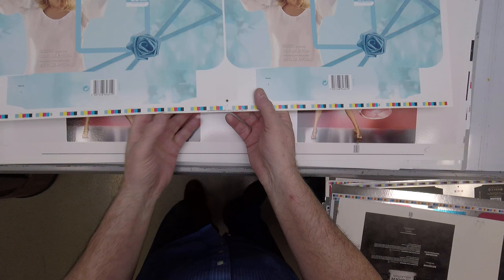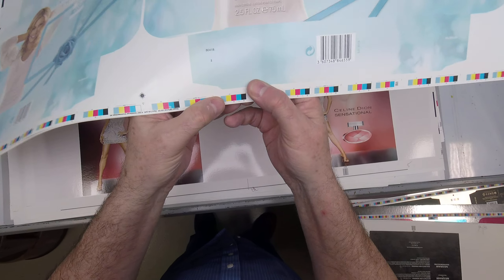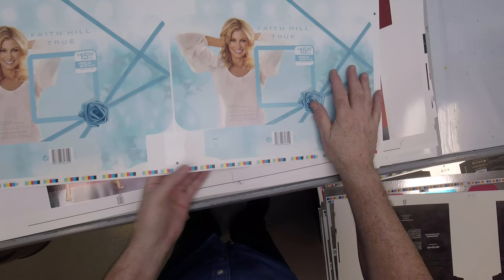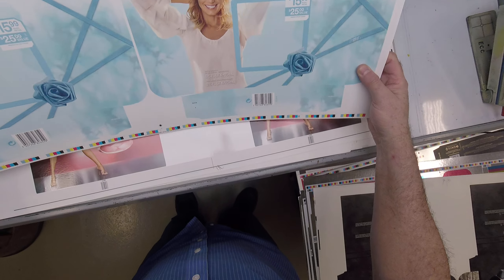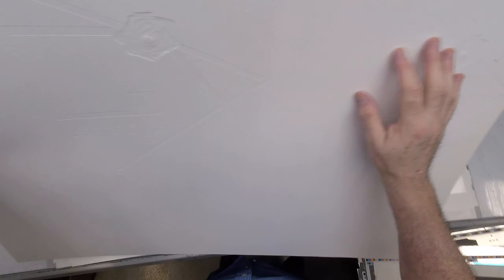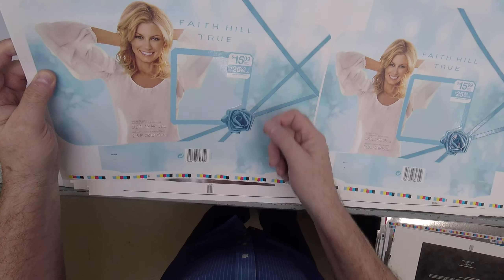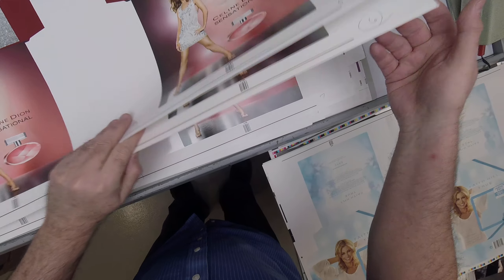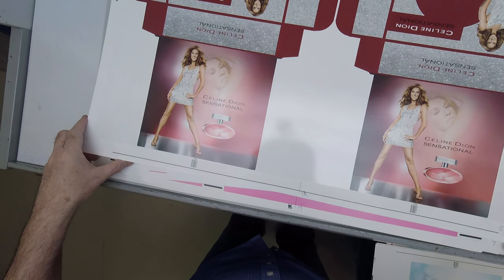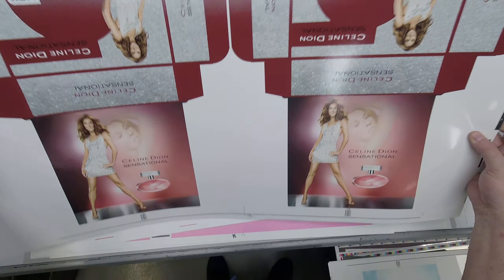Same thing here — this is stripped foot to tail. Again, typically we would come through the gripper with the color bar at the back. We're running four-color process, KCMY. And then this X color bar is for the spot color background. This press sheet has also been embossed — it's gone through a Bobst embosser. If I flip this sheet around, you should be able to see the backside embossing. This will be a die cut window with a perf for the tab. All UV printed, typically with a UV coating.